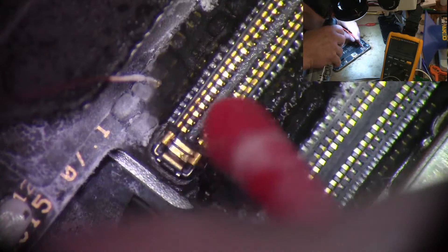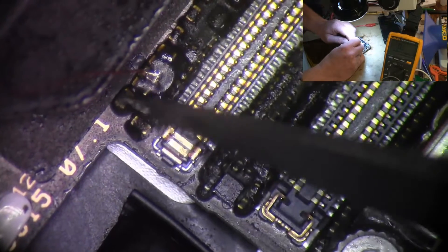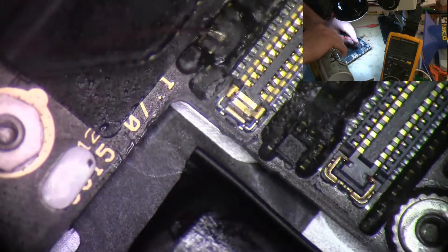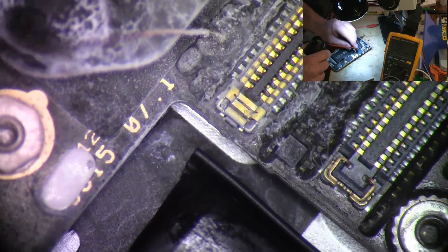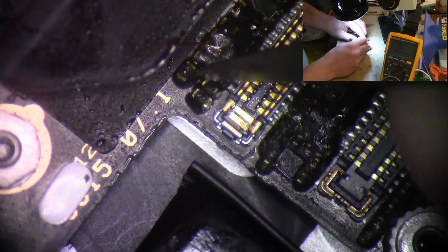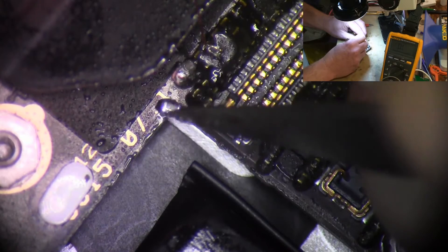You can probably use alcohol or acetone the same way. But this cap right here looks to me like it's shorted. Right there you can see it — so that looks to be what the issue is going to be with this phone. I'm going to knock that thing off. Alright, our short is gone now.